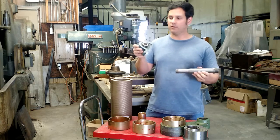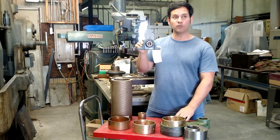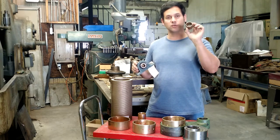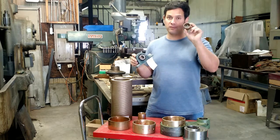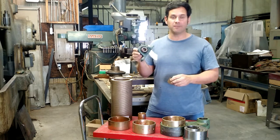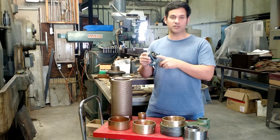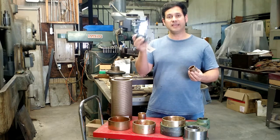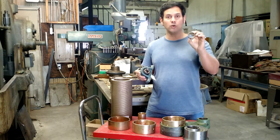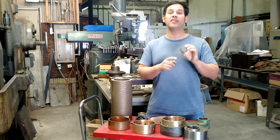So what are the disadvantages? Well, maybe it's not as strong or able to resist load — but these can resist a lot of load. This ball bearing is rated for high revolutions and high dynamic loads. The bronze bearing is rated for a much, much higher dynamic load, but much lower revolutions — about 1000 RPM max. You have to make sure it is lubricated or you will ruin it almost immediately. The ball bearing is rated for about 25,000 RPM, is easy to lubricate, sealed, and maintains its lubrication. High initial cost, ease of installation and replacement, no special tooling required versus very inexpensive initial cost, high load rating, low RPMs, and special tooling required. If your particular application does not utilize a standard size, then they are very, very expensive.